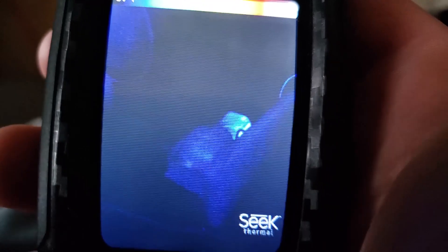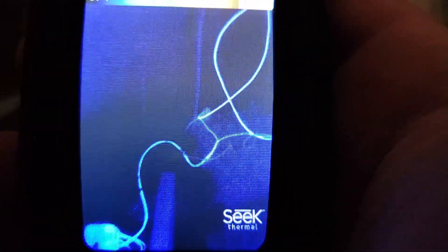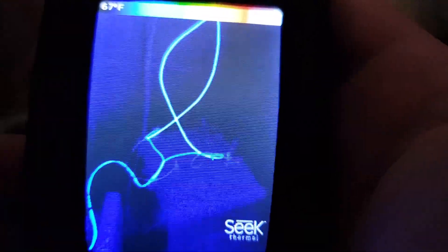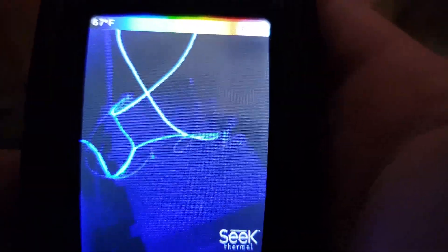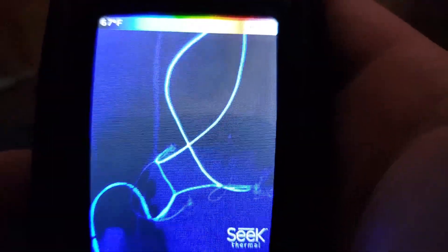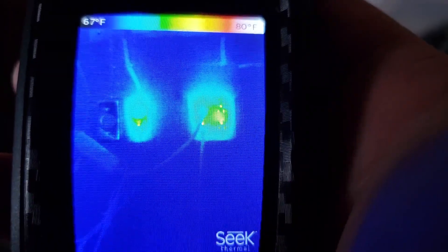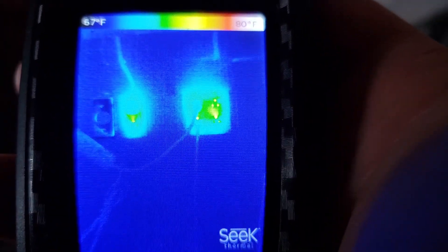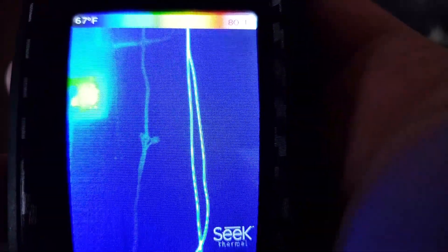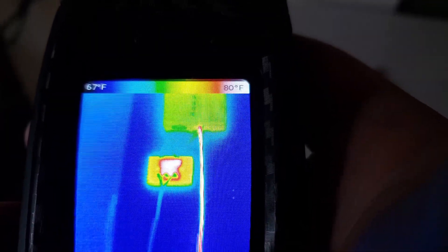Here's my thermal camera. We can see the charge controller is pretty warm. The wires coming in — just one wire paired up — are pretty warm too. We can see how it's wired in parallel with a cross-post wiring setup, so both batteries are loaded equally with the balance leads between. The wires are pretty warm. That's a GFCI — actually all of those are GFCI because technically this is a garage and garages need GFCI protection. We can see the three-phase coming in and the DC coming out on the left. There's the rectifier — it's getting pretty toasty warm. I need to add some additional cooling on that; I have some fat heat sinks I can put on.